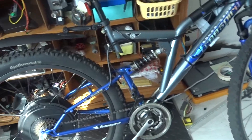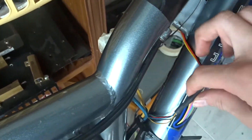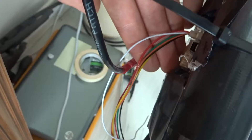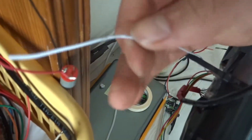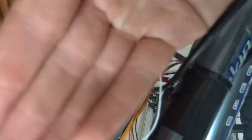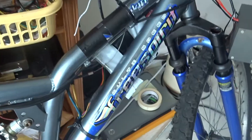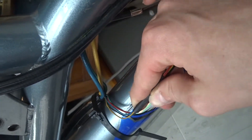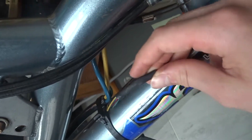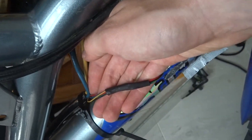Moving on, we have the sensors — these wires here — which run into the VESC into that port there. This white wire which isn't connected to anything is actually just a temperature sensing cable, and this motor doesn't have those capabilities so I'm not able to use that wire. I had to cut the connector off the motor in order to splice these two cables together, and just put a bit of heat shrink on it to make it neat and tidy.